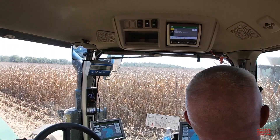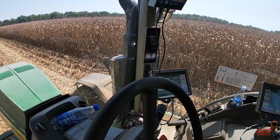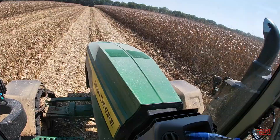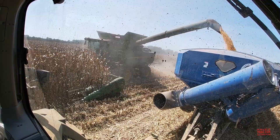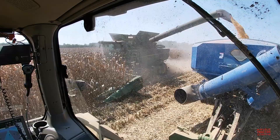On the go, the tractor is completely hands-free. The combine sets the speed, running at about 4.8 miles per hour, and you can see the combine moves a little bit, slowing up or moving forward, and the tractor matches that speed. You can actually see it steering itself on its tracks up front as the combine runs alongside. The combine is unloading 3.8 bushels per second through the 28 and a half foot unloading auger from the 400 bushel grain tank, moving a lot of corn and using a lot of technology as well.